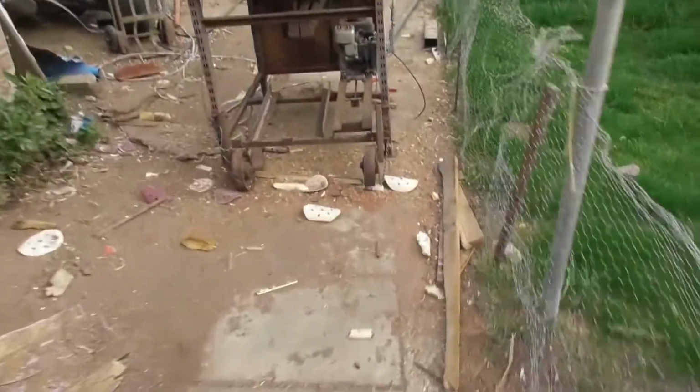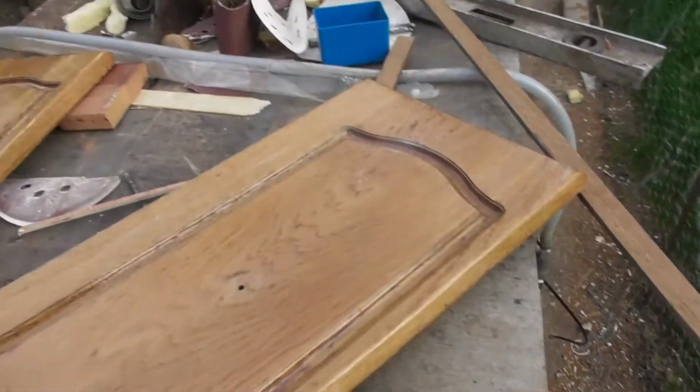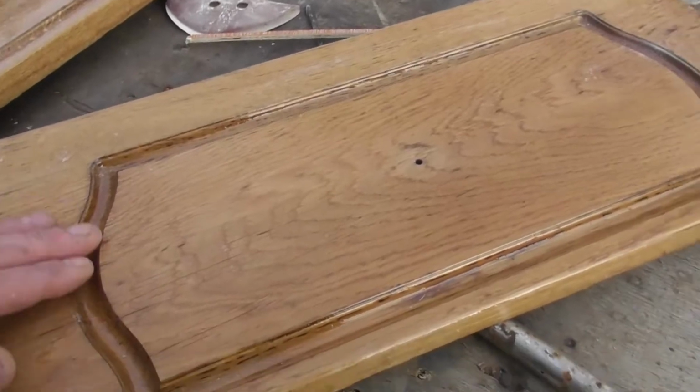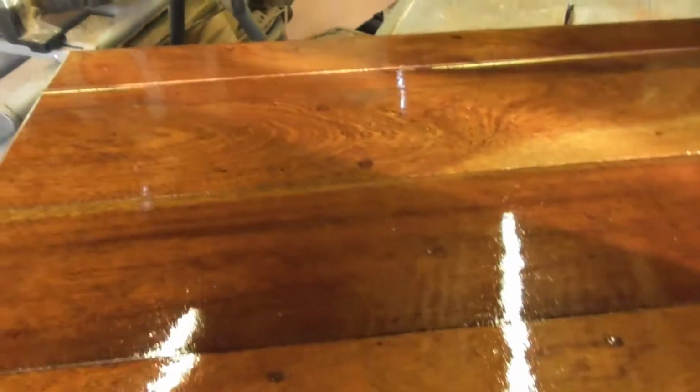The varnish work didn't go so well. Didn't allow the layers to dry properly. And this top layer, this last layer, and I can't remember what number we're at, 3 I think, dried too quickly because the sun was so hot. So it peeled and played up, and this one is also a bit too soft, so I'm going to have to leave those for a few days and then put one final coat on. Dust, pain in the neck, absolute pain.